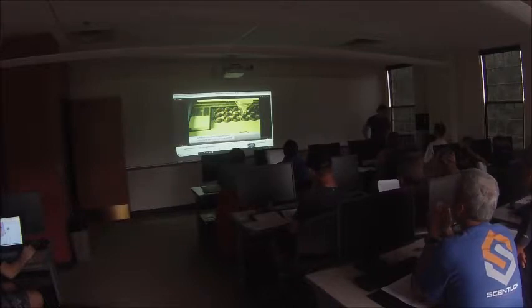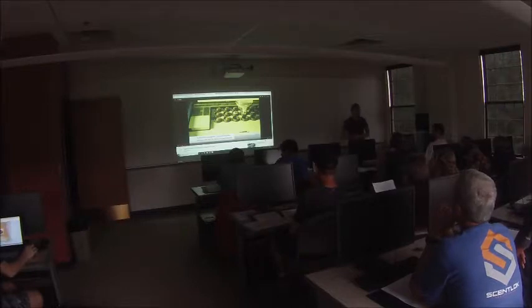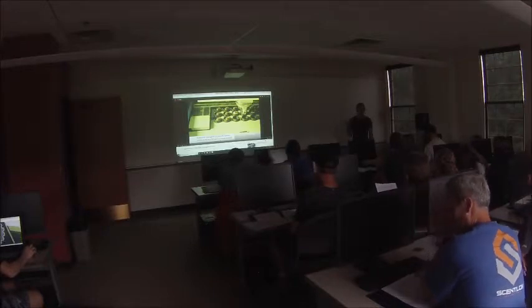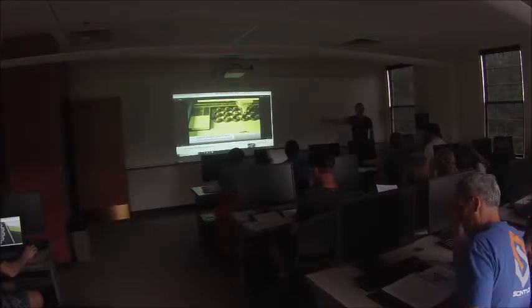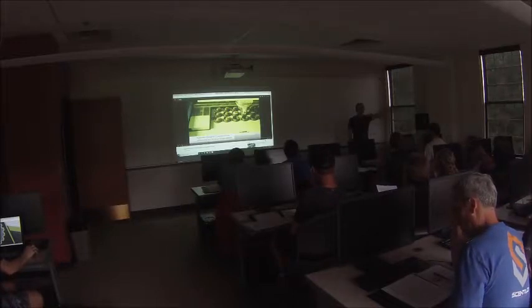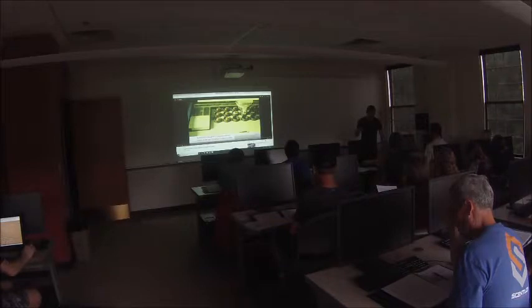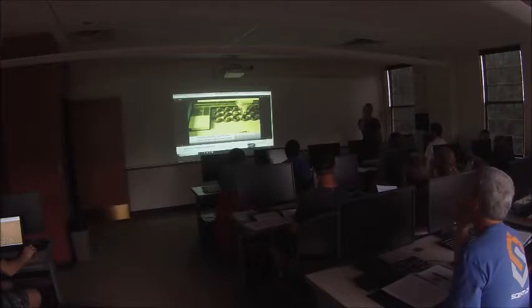All right, that's laser. Just a quick note about lasers: they're always CNC machines, because if you've got a guy with a handheld laser cutter, lasers don't really stop when they go through air. They tend to keep going. I was in a class for the laser cutter that we actually use. I used to work for the company that sponsors us, and I went to the training to operate the laser. Before the laser is focused, the laser beam is about 5/8 of an inch in diameter, about that big around.